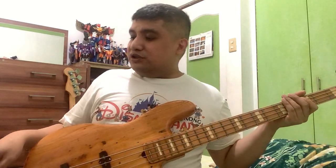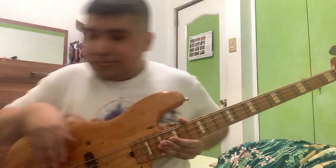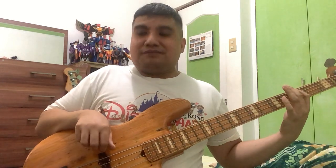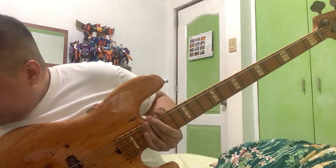The other way around also goes. If you want beefier sounds, you can turn down the mid-range and treble a little here in the amplifier. Now we have a little beefier sound. Or you can turn down the tone. Let's say I set the mid-range and treble flat, and now we turn down the tone. That made it beefier, so that's one option.